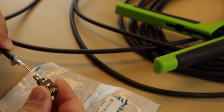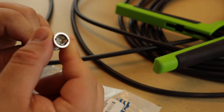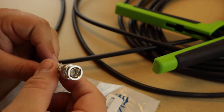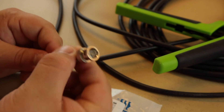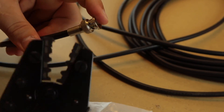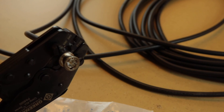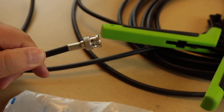Next, take your actual connector with the bayonet-style parts and slide it over the pin, making sure it locks in nicely, and push it down. I like to rotate it a little to make sure it's well seated. Then push up all the jacketing and wrap it around the base of the connector — make sure nothing is sticking out once you slide the sleeve over top. Slide the sleeve over, make sure everything's nice and tight, put it in the crimper using the .255 crimp size, line it up right against the connector on the jacket, crimp that down, and voila — you have a cable.